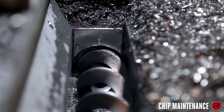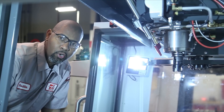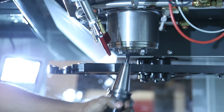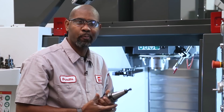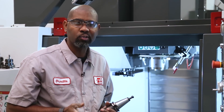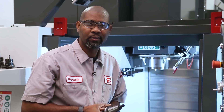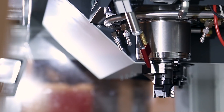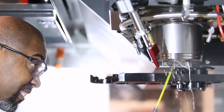Once that's complete, let's check the spindle. You know that pop you get when you have a tool stuck in the spindle taper? Leaving the tool in the spindle overnight can cause the tool to get stuck in the spindle taper. Luckily, it's easy to prevent. Just return the tool back to the carousel before powering down the machine. Then wipe the spindle taper with a clean cloth and give it a shot of light oil or WD-40.